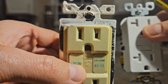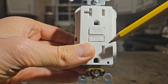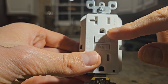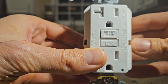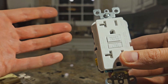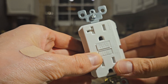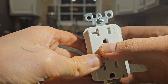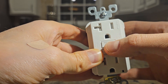The 15-amp outlets typically look like two vertical lines without the T-shape. Any outlet that has a reset and a test button is a GFCI outlet — that's the beauty of it. You can test it to see if it trips and then reset it. Something important: when these come out of the box and you install them, they likely won't work until you press the reset button first.